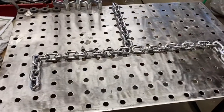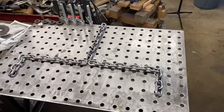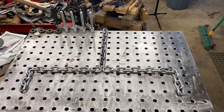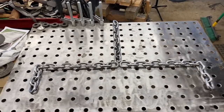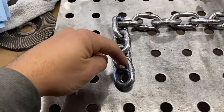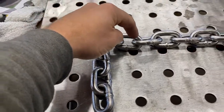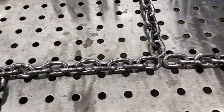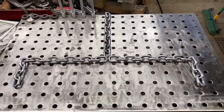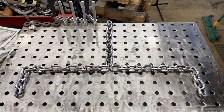Just a quick look at our layout — this is what our finished fixture is going to look like all welded up. I laid this all out by hand the way the customer wants it. Now what we're going to do is weld up every single one of these chain link joints on all sides throughout the whole fixture, and that's going to give us our permanent look the way it sits right now. Let's get welding.